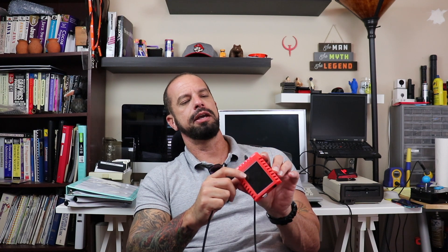It's got a USB port on the front used for flashing the firmware. If you need to upgrade the software, this will power itself from the SIO bus from most Atari 8-bit computers. I might be incorrect when it comes to the 400 and 800 — the older ones — because I'm not sure if they put out enough current. If anybody knows that for sure, leave a comment. And there's the SD slot in the back.